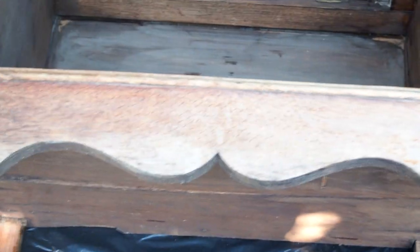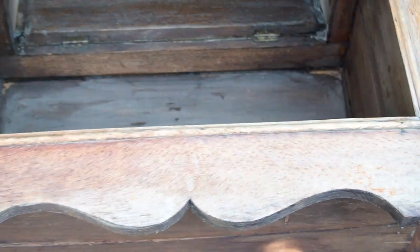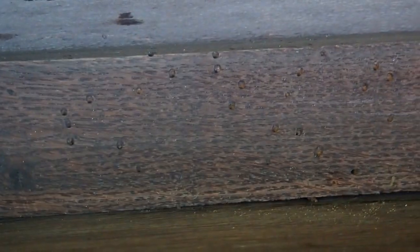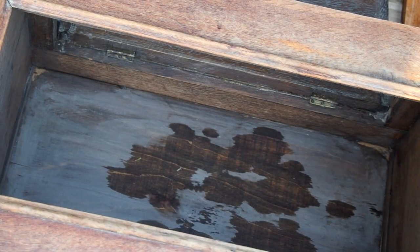You probably won't have an inside on your furniture, but if you do check inside as well. You can see on the back of this piece of wood where the liquid has actually come through — so it's getting any worms that are left in there. Just check all bits. There's a bit on this bar, it's old worm because it's dark, but I'm going to treat it anyway. Once I finish I'll leave it and treat it again tomorrow.